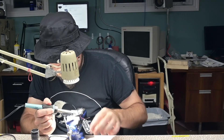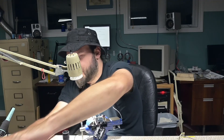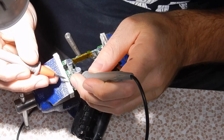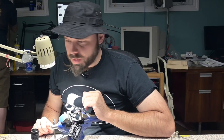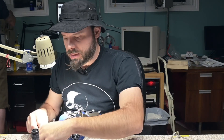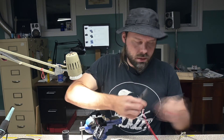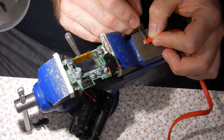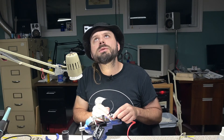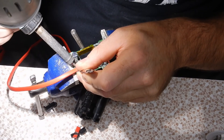The more I tweak on this the worse it's gonna get — the contacts are so small I haven't got the right tooling. Continuity test: pretty sure that's ground, pretty sure that's ground. So we've got grounds everywhere. Right here is positive. If we directly attach it to a wire, how do we get that wire in and out of the chassis? It's a split hole so that's not gonna be a big deal. We have some nice wires — let's slice back the insulation.